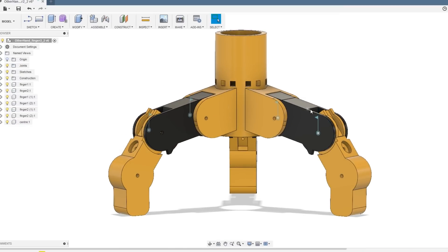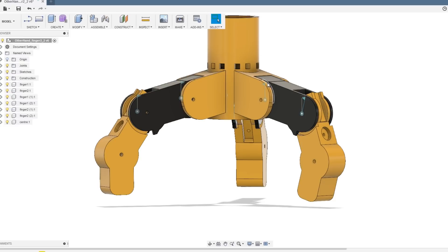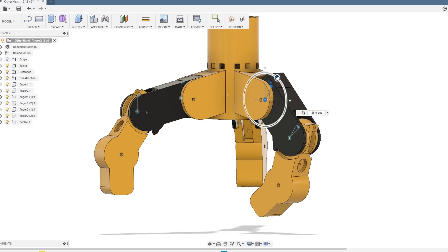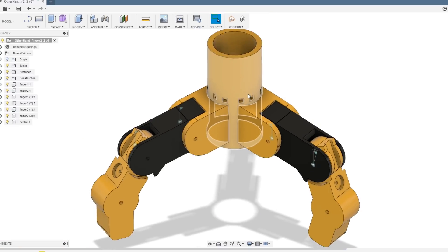So I've pretty much just taken the finger digits from Spider-Man's hands and scaled those up 50% to make them a bit chunkier. We might put some rubber things on the end to help grip, but that should do perfectly well, and of course we've got these joints at each place here, so we can position each finger. There'll be a bungee in the back of the finger that pulls it back, that's tied off to the wrist.